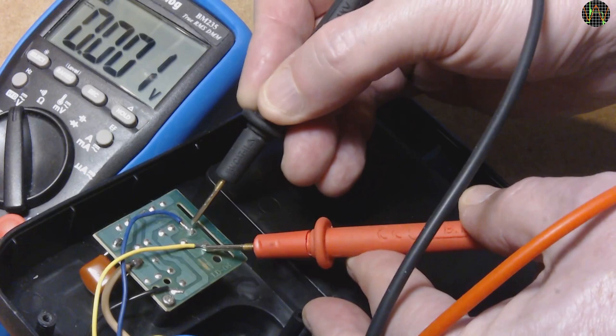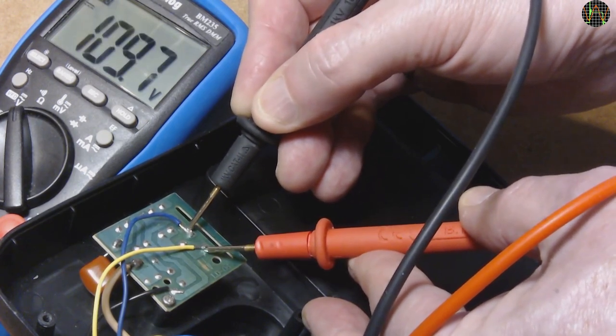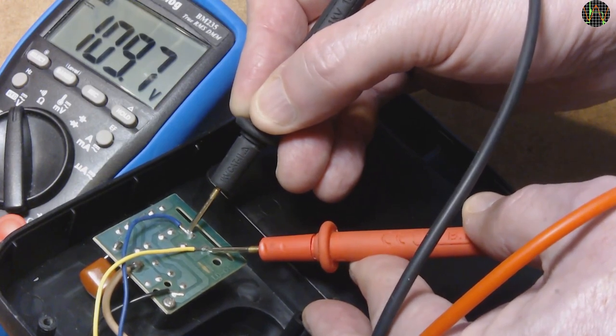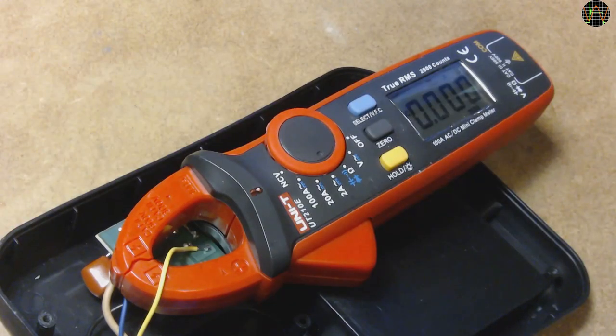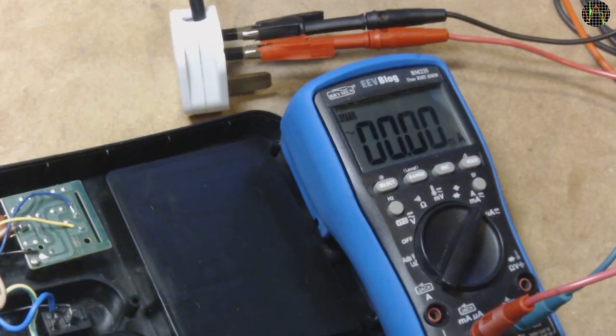Somewhat gingerly, as this whole thing is live mains, I measured the voltage to the 40 LEDs as 110V, so obviously they are all in series, which makes 2.75V per LED. And using a clamp meter, the current to the LEDs is only around 6mA. This means the lamp uses a whopping 0.66W light source — but I do admit it is bright enough. Such low currents are right at the limit of the clamp meter, so it might be 9mA, which makes the lamp a 1W light. I am measuring the mains current drawn by the lamp with a kind of scary arrangement, which you should never do at home unless you know what you are doing. We have about 12mA, so now we know what to expect when using the power meter for this job.